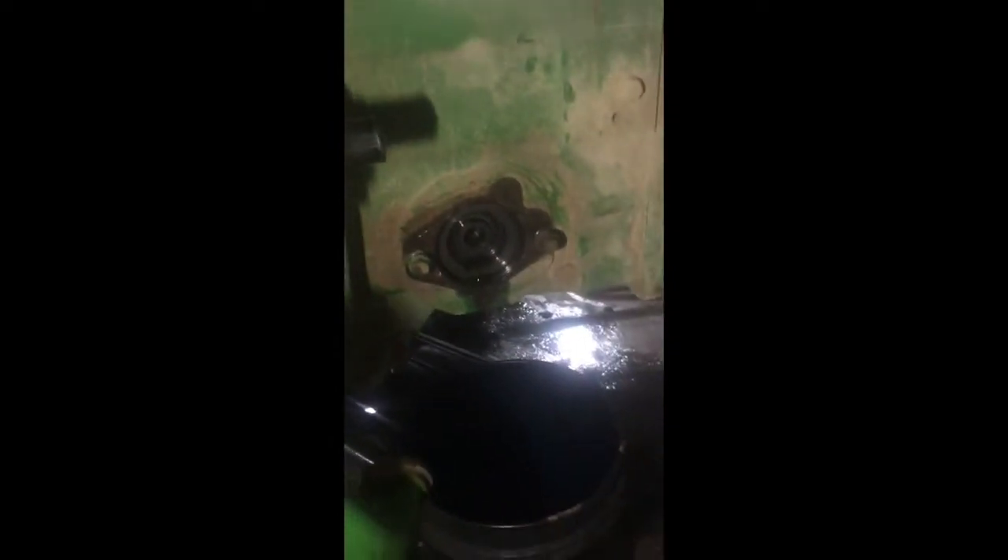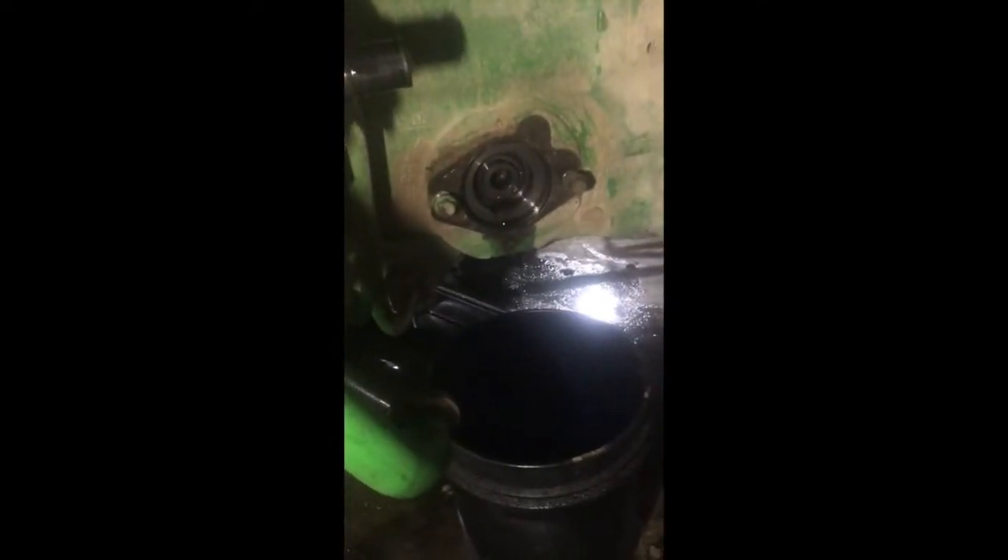There's one pump directly across from here. Your filter is right up there on that stub — that's where your filter would be. Take off both pumps, one on this side right there. Then the next step is taking off this bottom plate right down in here, and up inside there you'll find two shafts.